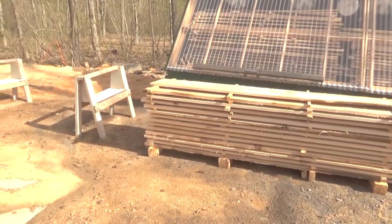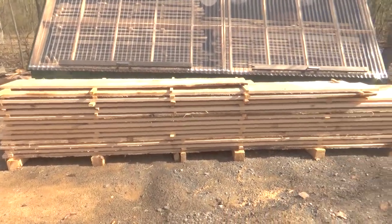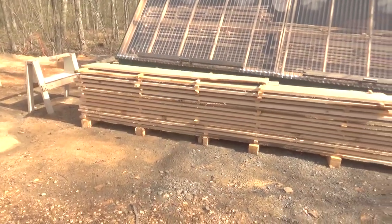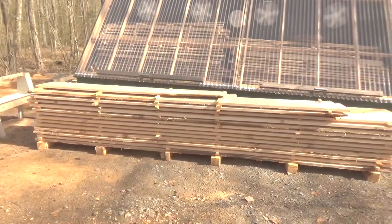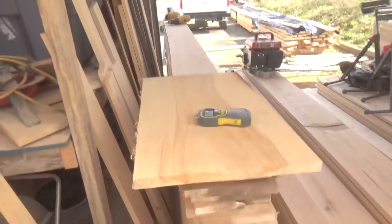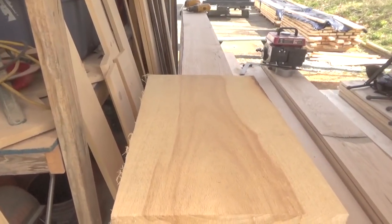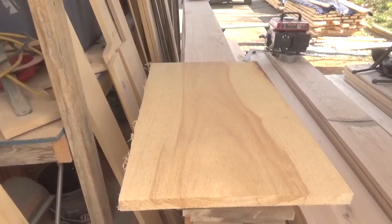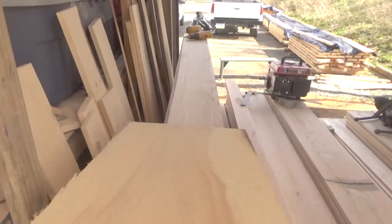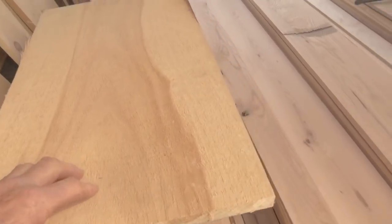But when wood is in this state — and this wood was just cut yesterday, so it's wet — it's got a high moisture content. I didn't bring my moisture meter with me here, but you're probably looking at 27% or more on this hemlock, or on this white pine. So I'm in the greenhouse and I just want to show you something here. When I started cutting pine, this piece came out of a flitch, and I really liked what I see here — this is nice and straight. It's flat, it's not cupped or anything.